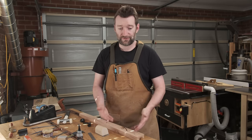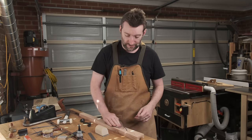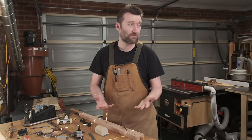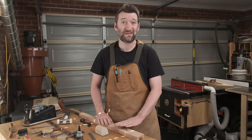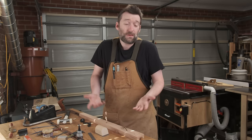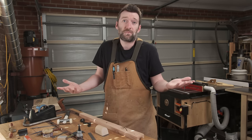For this type of thing it's genuinely speeding up my workflow on furniture projects — five-minute turnaround and I've filled it, I can sand it. Apparently it's completely stainable as well if you sand it first to open it up, and you can then stain it just like wood and apply your top coat. I've applied top coats to this before and noticed no difference between it, epoxy, or even wood. End of the day it's just another tool in the tool bag. Maybe it's the right thing for you, maybe it's not. Maybe you already knew about this and I'm just talking too much. Either way, thanks for watching.